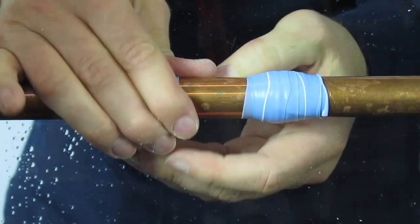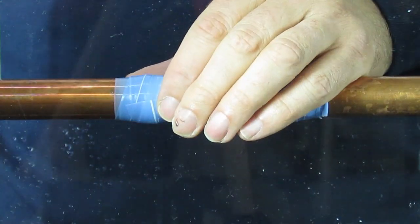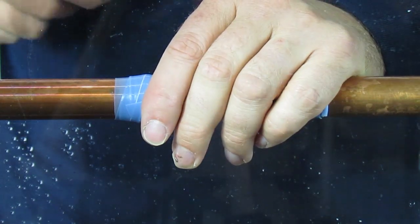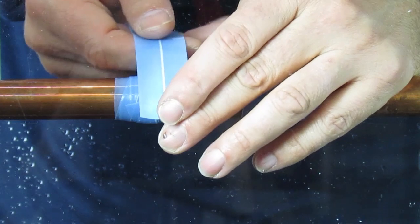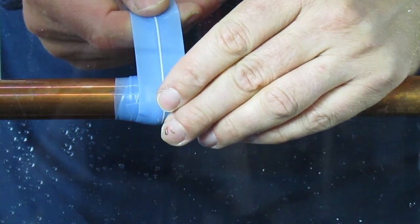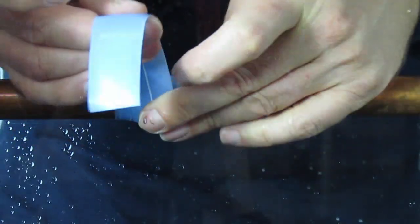Once you've got an inch wide on either side of the leak, you can put on the protective layer, which is basically the tape at low tension. It protects against abrasion because it's not at high tension like the bottom layer. So you end up with one layer sealing and one layer protecting.